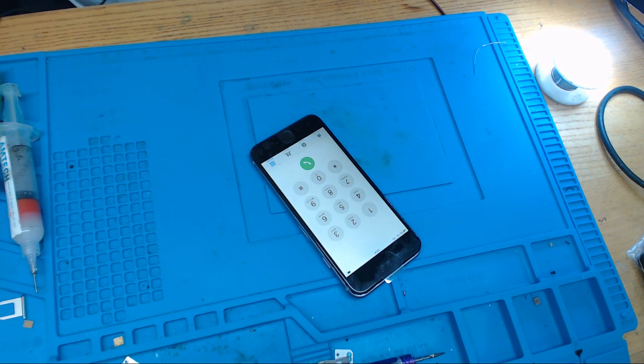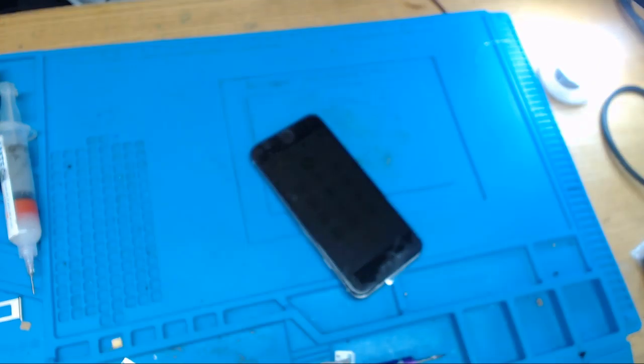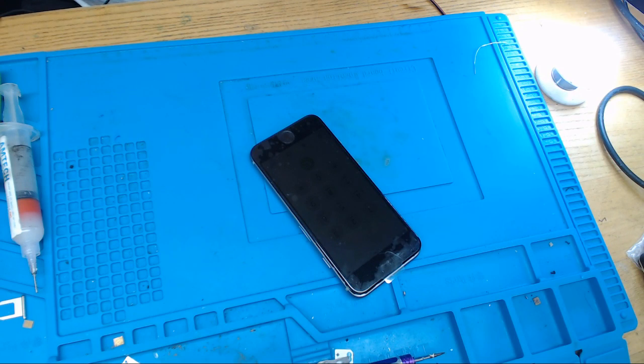That is RFFE1_DATA. So if you're going to run a jumper for that one, even though that is going to work, I would recommend that while you are there, you can run the GPS line jumper as well. So in case in future the phone flexes and there is flexion in the board or the phone drops, you can have that pad not break.